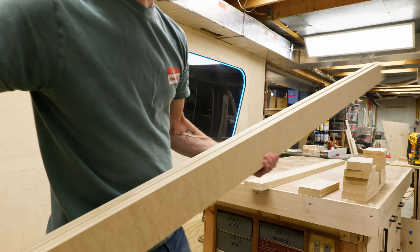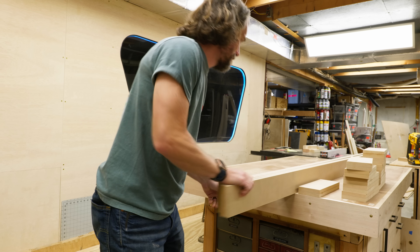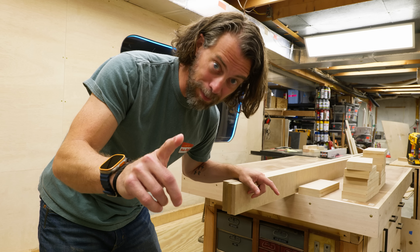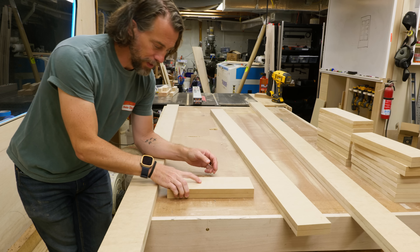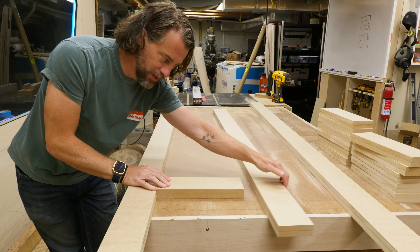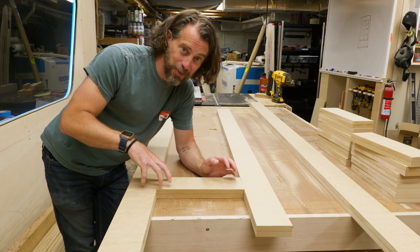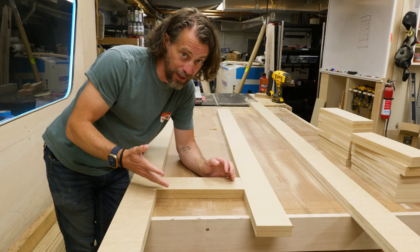I only say that because you could skip forward to right now if you were going to be using dimensional lumber, but I'm having to make my own. How you get these pieces connected is going to be exactly the same no matter what you're using. We've got to attach all these different pieces, but we don't want that attachment to be visible at all, so we're going to use splines. Basically, we want this piece to attach to that, this piece to attach to that, and a whole bunch of others, but I don't want to see any fasteners — so we need to do that attachment on the inside using a spline.